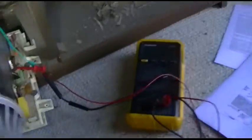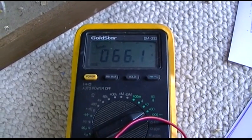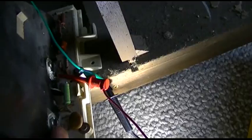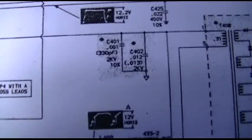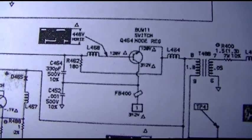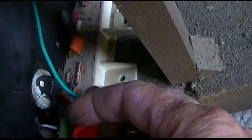I'm doing a couple quick checks here. There's still voltage there dropping down from the charge of the capacitor. I had it on a minute ago but this is the regulator and this is the horizontal output, and the horizontal output has zero volts on the collector. If you look here you can see the horizontal output comes up through the coil, through L401, and it ties right to the emitter of that transistor. I'm on the collector — maybe I should switch to the emitter but I don't think it would be any different.